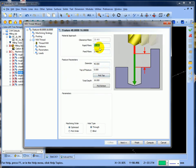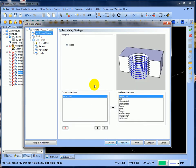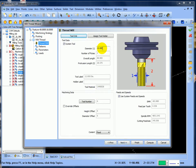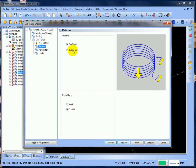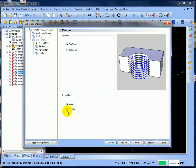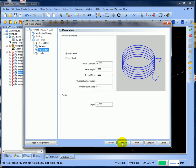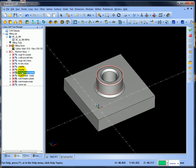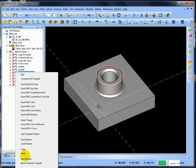I've set my top of job and diameter. Next I'm telling it I'm doing a thread. Next, work offset, arc moves. Next, told it what the tool is. I'm going from top to bottom and I'm doing the outside - you get the choice between inside and outside. Next I put what the thread diameter is, thread height, thread pitch, threads per revolution - just one, start angle at zero. Next, lead in lead out - cancel that. So that gives you some idea on the single point thread parameters.